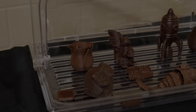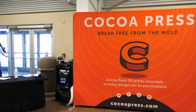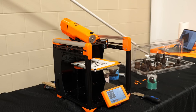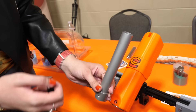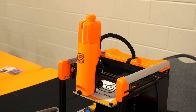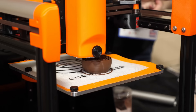From high-tech nylon filaments to probably one of the most interesting and delicious 3D printing technologies I saw at the Rocky Mountain RepRap Festival — this was Ellie's CocoPress, a chocolate 3D printer that doesn't suck and is able to print this super tasty brown mass with incredible detail. The CocoPress doesn't only look similar to a Voron Zero — the Voron team even supported her in the design of the motion system. The heart of the chocolate printer is a stainless steel syringe-style printhead and custom-formulated chocolate. Models are sliced with a regular slicer and the standard nozzle is 0.8mm in diameter. The two heater zones control temperature down to a tenth of a degree, because even slight variations change the viscosity of the chocolate.